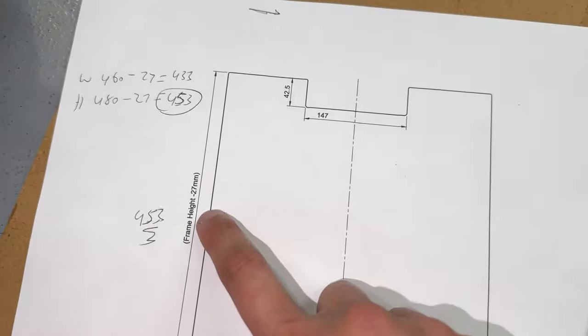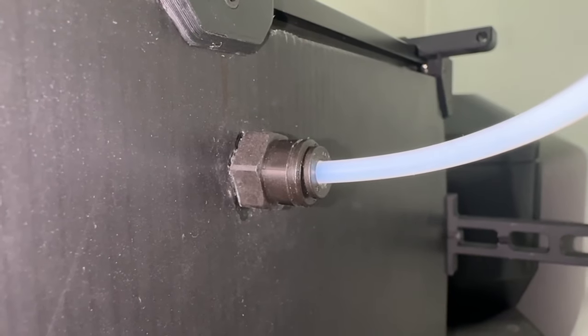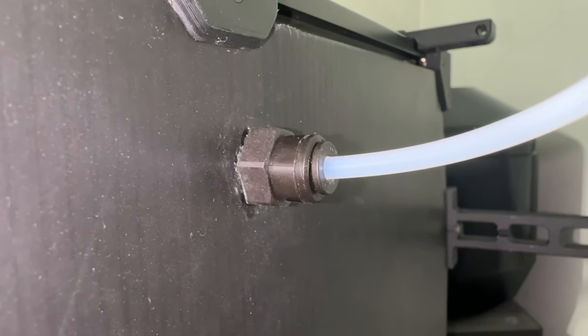On the bright side, I am going with the Nevermore carbon filter. Therefore, I don't need the exhaust hole anymore. I recut a new panel, drilled a small hole, and glued the Bowden coupler in that same spot. I can always modify and revert to the stock exhaust later.